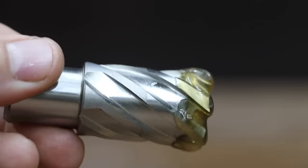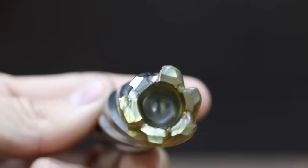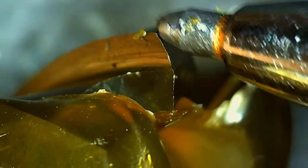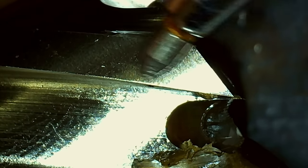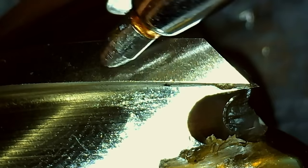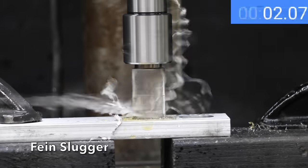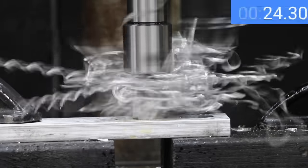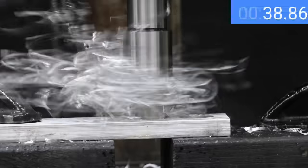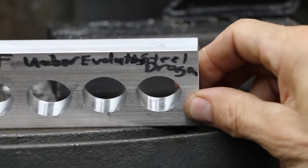At a price of $362 for 11 cutters ($33 each) is the Slugger made by Fein. All cutters by Fein come with a protective coating, are made of M2 high speed steel, and feature multiple cutting edges that create accurate, burr-free, high-quality holes — claiming to drill holes three times faster than twist drills. Sizes range from 7/16 to 1-1/16, made in the USA, and weighing 97.9 grams. The Slugger makes pretty quick work of the aluminum but not quite as fast as the Milwaukee — 39 seconds.